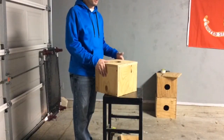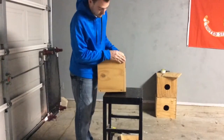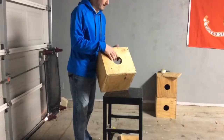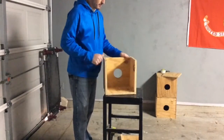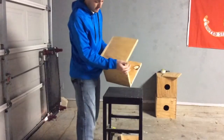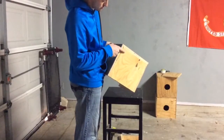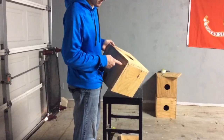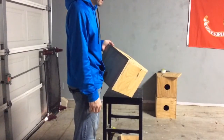Next, you're going to want to put on the 12 by 12 inch pieces. Make sure it's nice and level. Don't worry about the hole yet — that's the last thing you want to do. Once you have the 12 inch side on, do the same thing on the other side and put the other 12 by 12 piece on — make sure it's flush. Something to keep in mind is screw placement: if I have a screw going this way and I was going to put another screw right here, I'd hit the first one. So just off-center it a little bit — that's all you need to do.